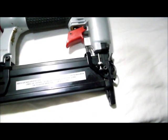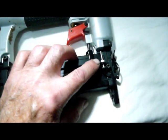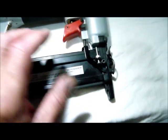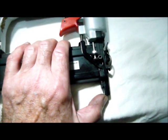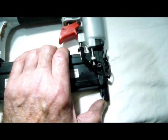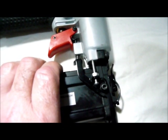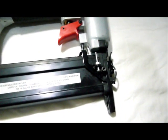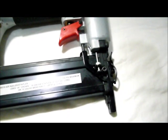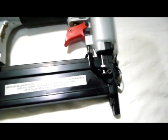What that allows me to do is put the screw in or out depending on how far I want that staple or brad to be driven in. And as you can see, when I push up on the safety mechanism, that screw will bottom up on the bottom of that casing. Seems to work pretty good. I'm not sure why they don't include that with the tool originally — it would probably cost them another 25 cents to put that on there.